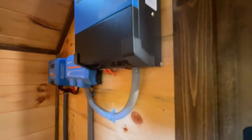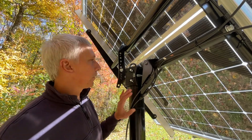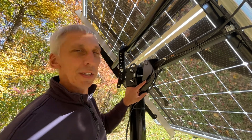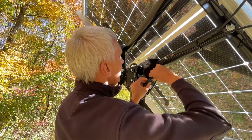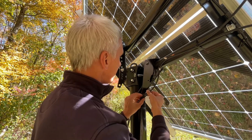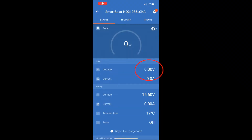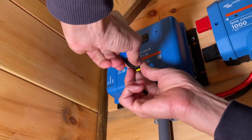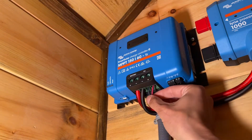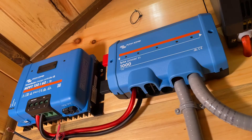So let's take all these components off. First thing we've got to do is disconnect the PV array. I don't have a disconnect switch on the inside — I'm using the MC4 connectors as disconnects. I have about 100 volts on this system. Disconnected — I'm verifying zero voltage coming in from the PVs, so good to go, safe to disconnect. I've verified that my charge controller is at zero volts, so it's safe to take off my PV leads from the solar array.